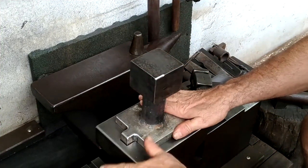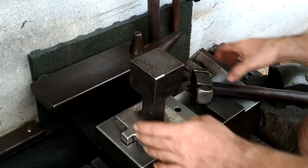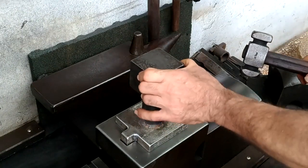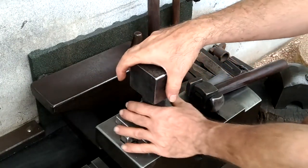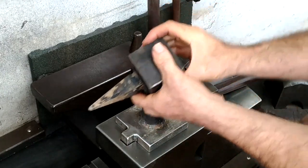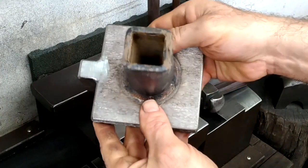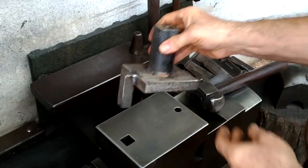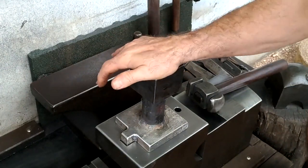For the time being, I've got my stump anvil in this homemade jig. I thought it might be too high, but I've used it once and I kind of like it. Within the pipe, which I formed 1-inch square on the top end, I put some clay in to take up the space left by the tapered shank on the bottom end. This way, there's less wobble. Not perfect, but works.